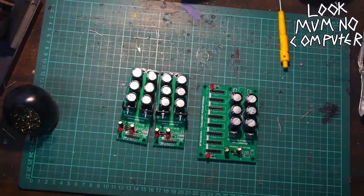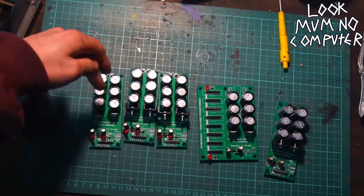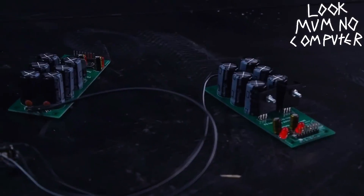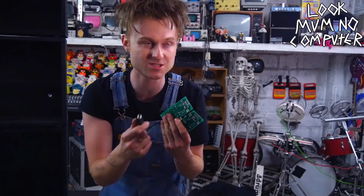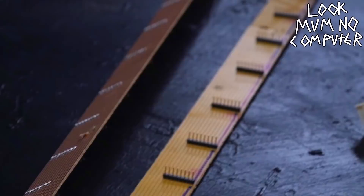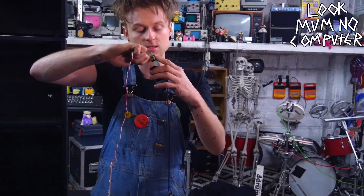Done! And then I've built some more. I've got five power supplies but only three cases — two of the cases have two rows and one has one row, so that's five rows in total. My rule of thumb is one power supply per row. The great thing is you can hook these up to the same power plugs — the two wires can be soldered to both in parallel. I've also made these very simple bus boards, which take the power and distribute it across to all the modules. It's just a long thin piece of strip board with some pin headers.